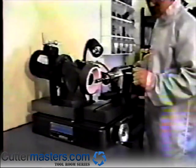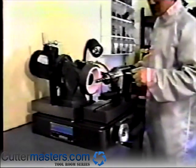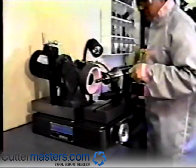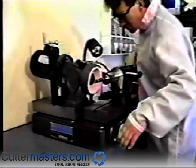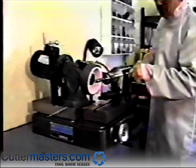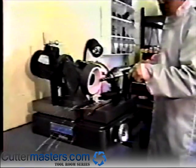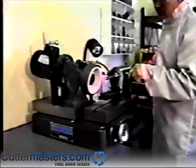After positioning the end mill on the stylus, turn the motor on with your left hand. Advance the grinding wheel until the wheel touches the OD of your end mill, and then feed another 2 to 3 thousandths. Pull the air spindle to the right, being sure to keep the tool on the stylus, using a slow, steady movement. It may take a little practice to get the feel of this.